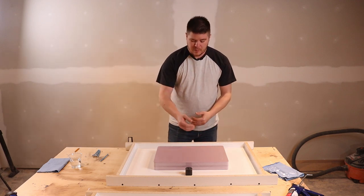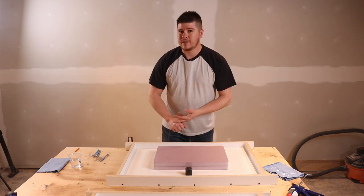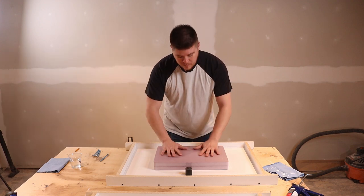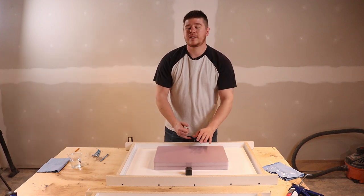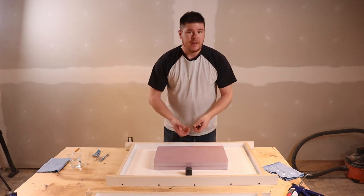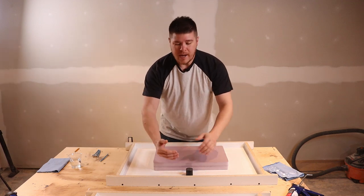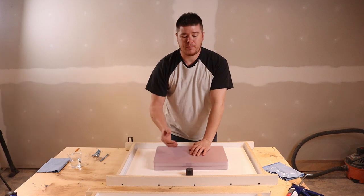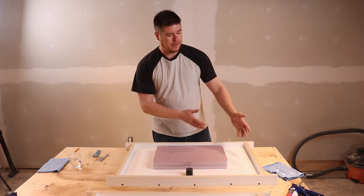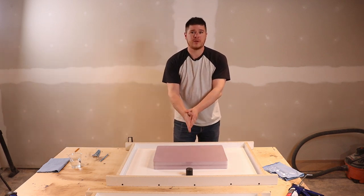On the leading edge, we have to be aware we have a 1/2 inch overhang, plus we have the thickness of our doors, plus we have the thickness of our top stretcher. Then we have to leave a gap, and then in front of the knockout itself, you gotta remember, we're using an undermount sink. So there's a 1 1/2 inch flange that runs all the way around we have to account for as well. And then on the back side, we also have to account for our backsplash. Another thing, my vanity is gonna be pushed up against one wall. It's not gonna be centered, but I want my sink to be centered with the doors on the vanity.